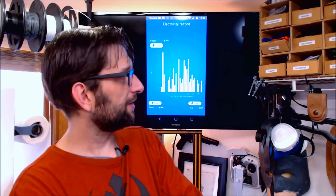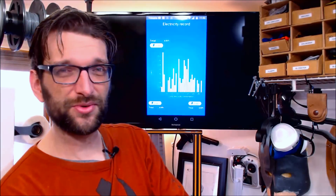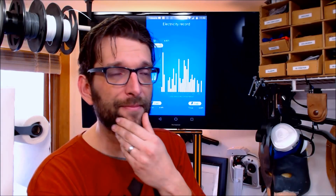With PLA, the average is about 2 kilowatt hours a day. So 2 kilowatt hours a day at 14 cents a kilowatt hour — we're looking at 28 cents a day to run the printer. The effect of running this printer is essentially the same as having a couple of incandescent 60-watt bulbs running constantly. The cost is not huge.